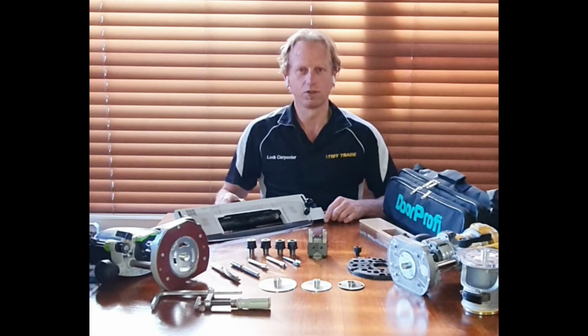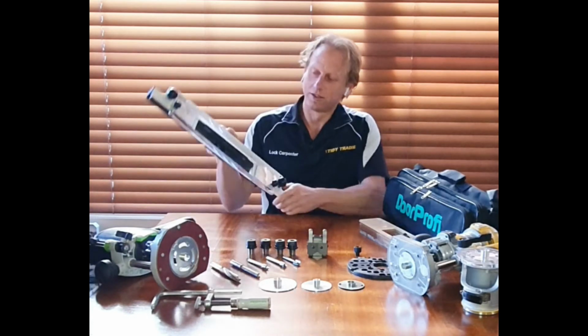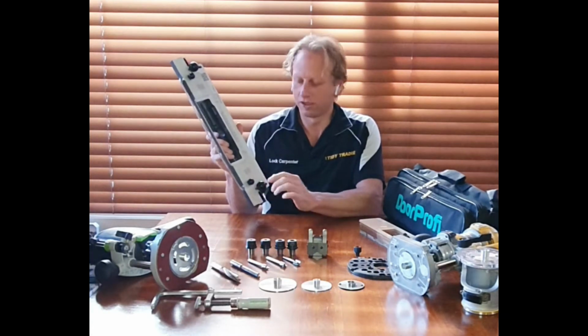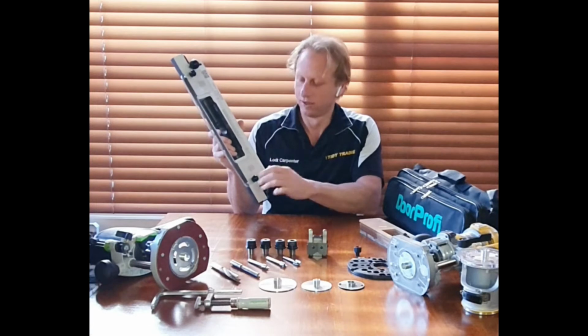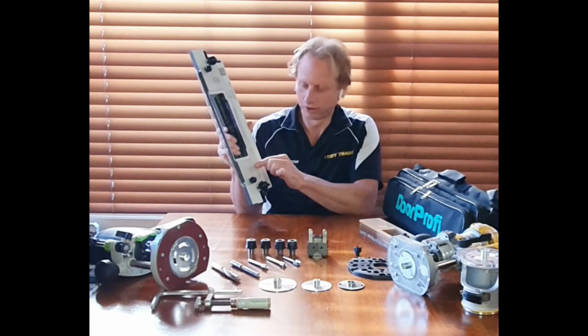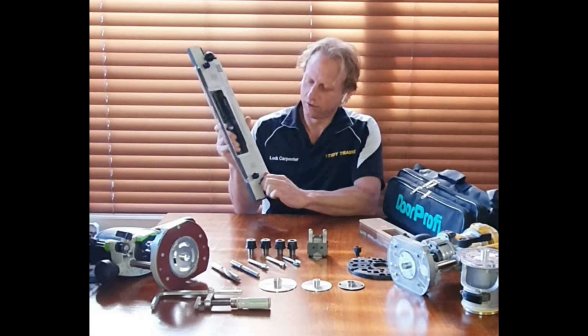But when you start doing lock bodies, concealed hinges, cavities for pivot door hardware, things like that, you need a long reach cutter. So this is fully adjustable. You don't need a screwdriver each time, you don't need an Allen key. You do everything by hand. You just turn the knob, move this from side to side, look at your little gauges here, so you work to the half millimeter or the millimeter, and then you just tighten it off.